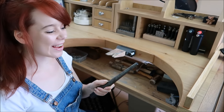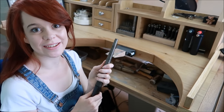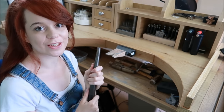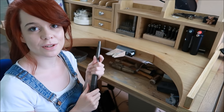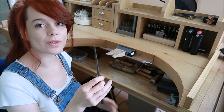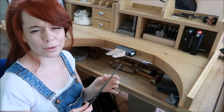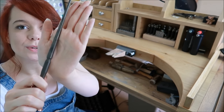A couple of steel mandrels — I have this ring mandrel here which has all the UK sizes on it. This is for making rings; you can hammer on it, it's steel and hardy. You definitely need one if you're going to be making rings. I also have a smaller one which I use for jump rings or making stone settings to get things nice and round.